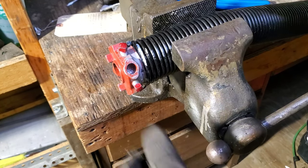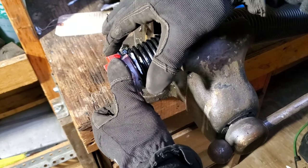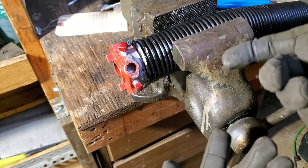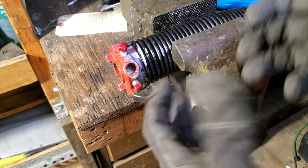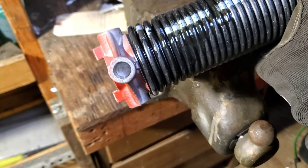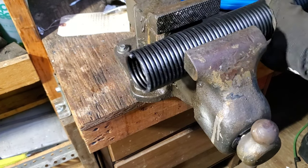I don't like to get too crazy with threading the cone on. My big thing is I don't want it in my winding bar area or right where I do my set screws, so I'll leave it right there — that's good enough. I've particularly never had one pop off unless you wind them the wrong way. You don't have to get it on every thread — it's not that kind of science. So there we go, there's one. It's almost like when you take them off you go horizontally in the vise, and when you install them you go vertically. Now we'll get the stationary cone on.